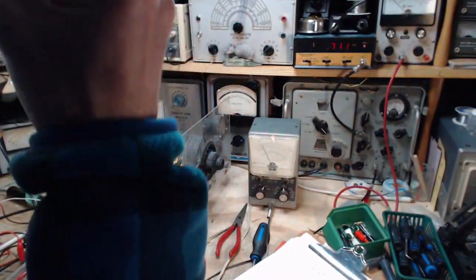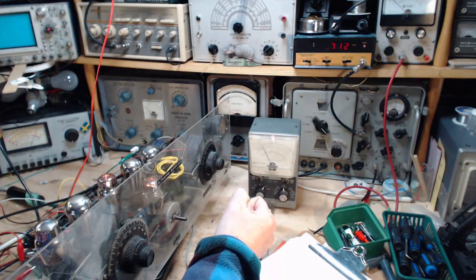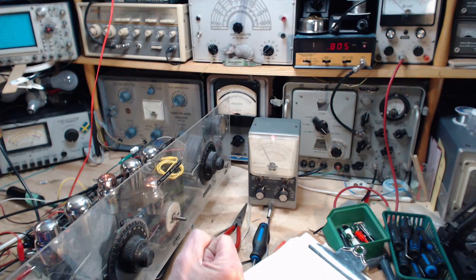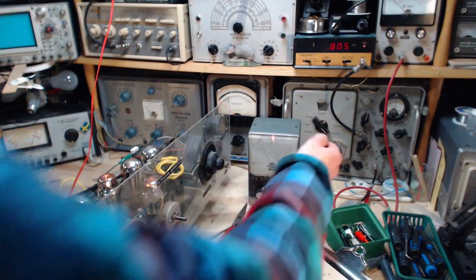So now we're sending what would be, to a normal radio, a pretty strong signal on the antenna. Make sure the volume's up on my tracer. Okay. So what we're hoping here is that some mixing is taking place in the first tube, and that mixing is going to result in a 75 kilohertz. Let's give it the works. This is it. You work now, or this is not an appropriate approach. Nobody home.